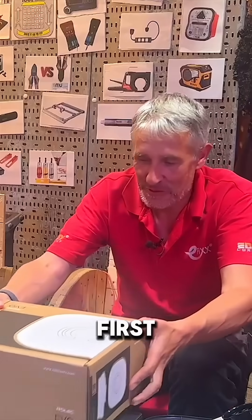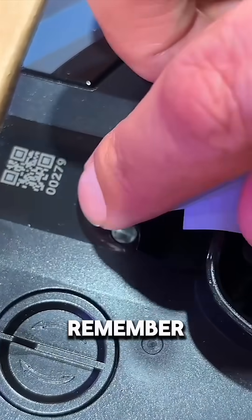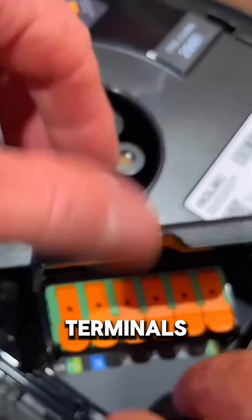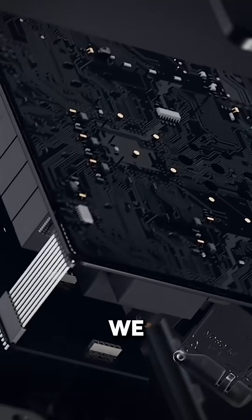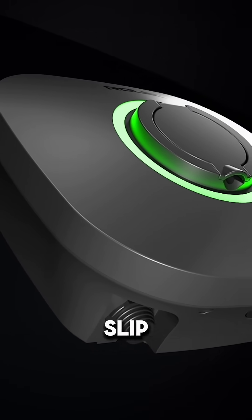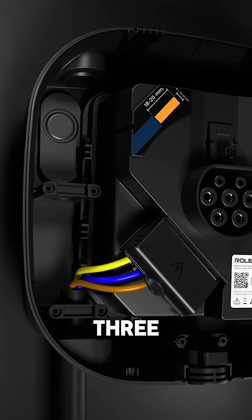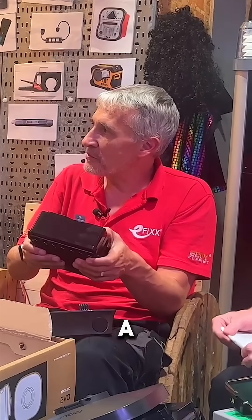It's a world first — on camera, this is the new unit and Dave hadn't seen this earlier on. A lot of chargers, you take the cover off and you end up with the front cover flopping around on a bit of cable. There are your terminals for the three phase. Looks like there are two protective earths — with one SKU we can cater for both UK and European markets. Same approach for the back cable exit. And there's an RCD in there as well, which is a rare beast for a three-phase one. You might get one in single phase, but it's quite rare to find a full-fat RCD.